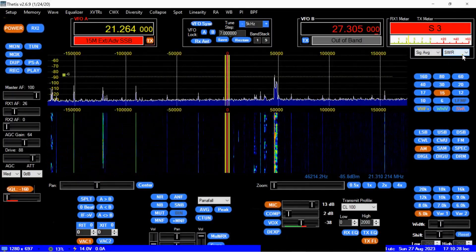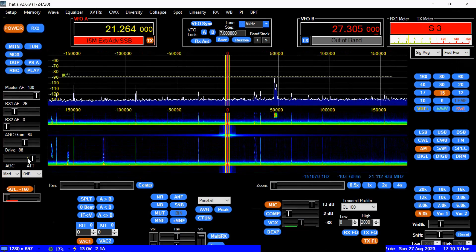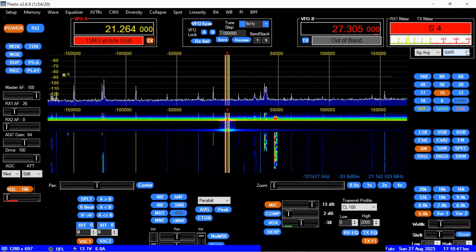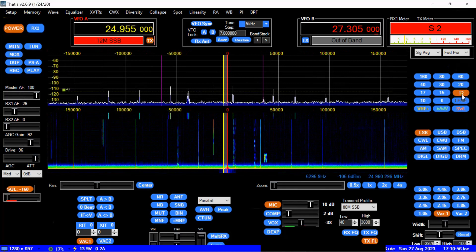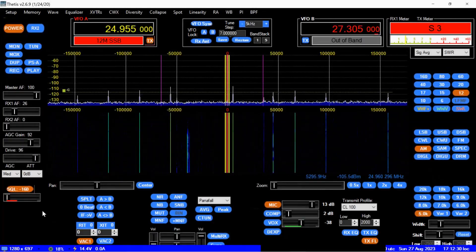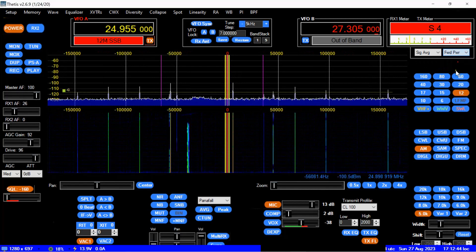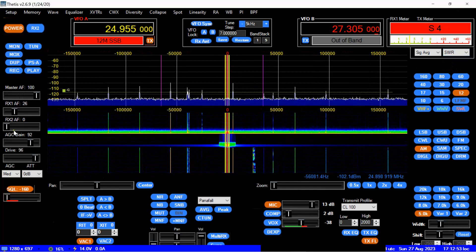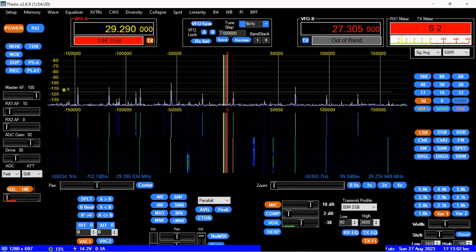15 meters — it is clear, SWR here we go. Key up — one to one SWR, full power, about 9 watts. Keep in mind it's working through the software so I have gain settings in the PA settings. Forward power looks good. On to 12 meters — 24.955, key up. Wow, see how fast the auto tuner adjusted — about one second. Then on we go, let's turn it down a little. Up to 10 meters for fun.